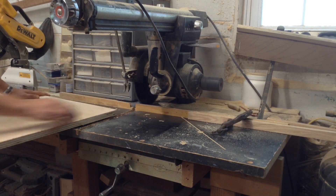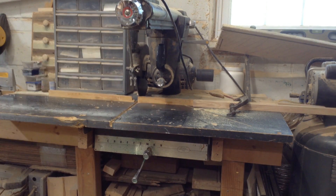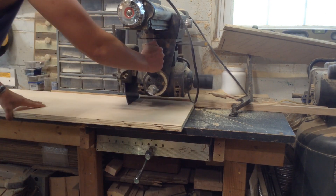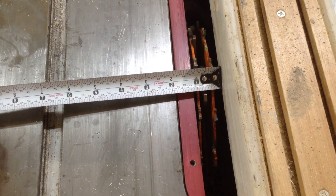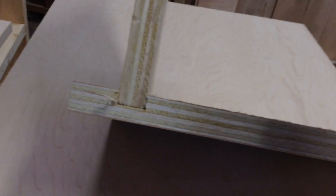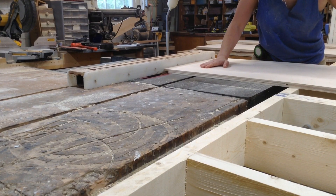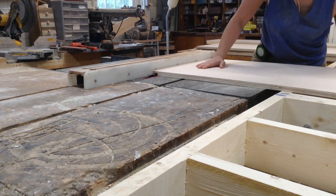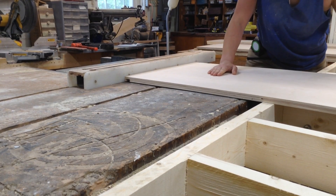All the pieces are going to be the same height, so I took the eight side panels — four for the back and four for each wing — and cut off the tops on all of them. This radial arm saw is not going to give me the nicest cleanest cut, but this is going to be painted, so you can take some liberties. You can hide and fix mistakes more easily with painted furniture. Then I go through and start putting my rabbets and dados in. For the base I like a little bit of a flange on the bottom, so I set up my dado stack to cut the perfect thickness, using the base as a wing to make these cuts safer.